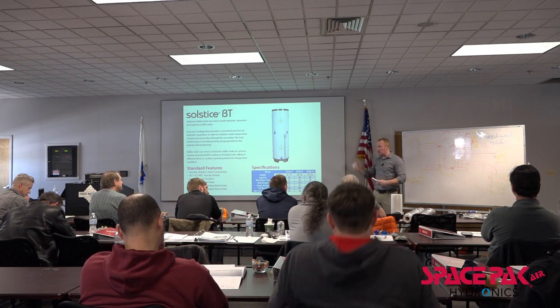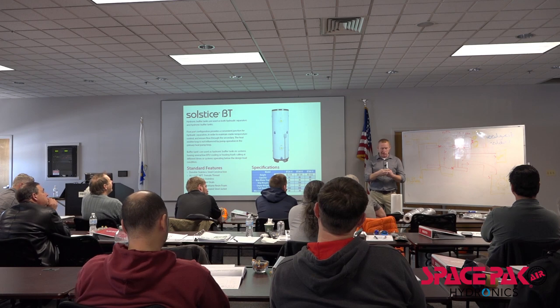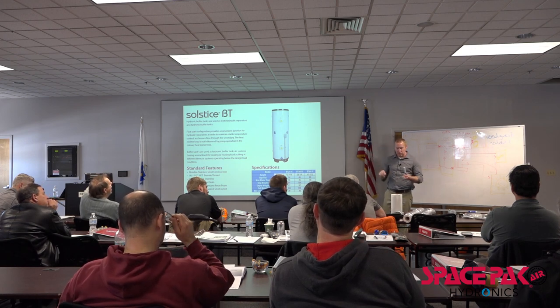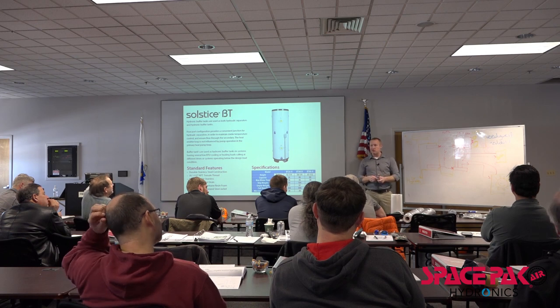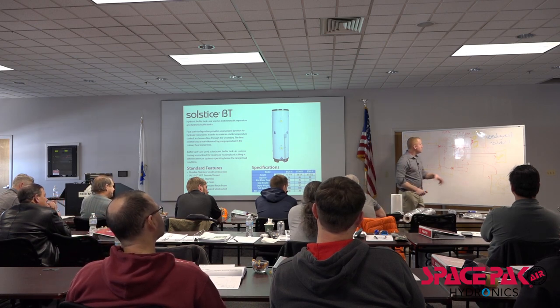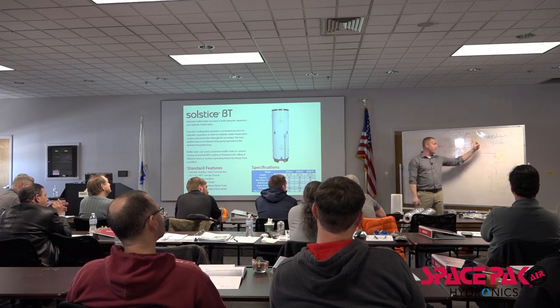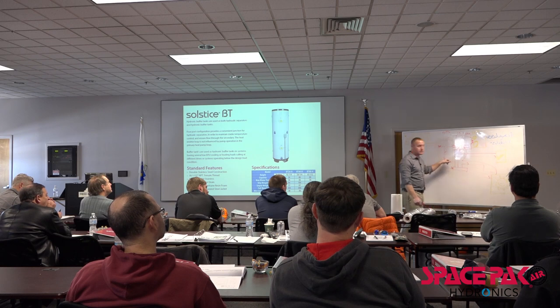So if we have our low ambient heat pump, and we know that we're gonna handle all our load until it gets down to zero, and I think at 0 degrees, we're gonna turn on our boiler, our oil boiler, our electric boiler. We're gonna turn it on. So we have a control that's gonna say, okay, we're gonna shut this guy off, and we're gonna turn the boiler on to maintain this buffer tank's temperature, okay?